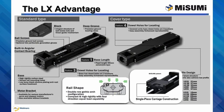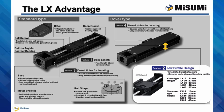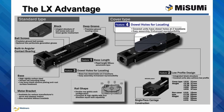The construction features double-row gothic arch bearing races, providing high rigidity with four direction equal load bearing points, and a single-piece carriage construction, offering a stable base for a load. The base length of the actuators can be configured in 50 millimeter increments up to 600 millimeters. It has a low profile design, helping save space when building machines. There are integrated dowel holes for locating pins on the base of all LX actuators that help make assembly easy without time-consuming alignments. The carriage for the hardcover units also comes with dowel holes for easier assembly when installing or performing maintenance.